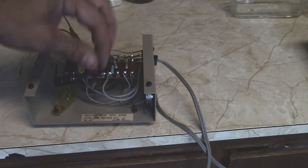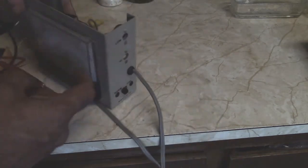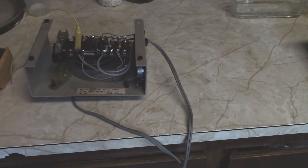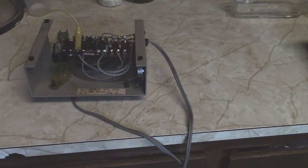What I found was this resistor. There's a zener diode in there that acts as a reference — about 16.1 volts. He was correct: as the thing stayed on longer, it drifted further and further down. He had also horribly misadjusted it just to get it to show up. I started watching the zener diode and noticed both this resistor next to it and the zener were getting pretty warm. So I took this resistor out of circuit — it's supposed to be a 10k, 2-watt resistor, but it was barely even 1k.